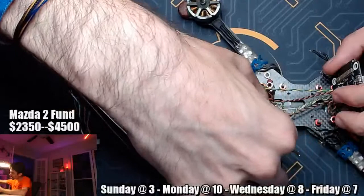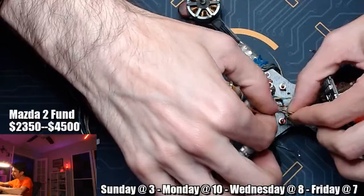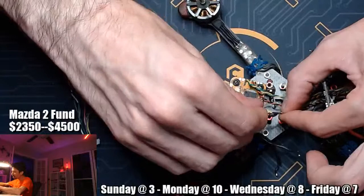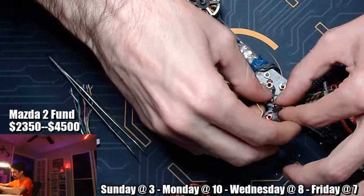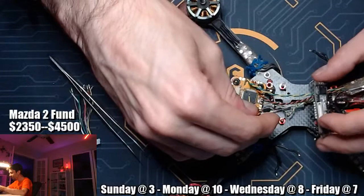And again, this is a little bit different. This rig I have the camera being powered by the 5-volt out on the VTX. That is a very clean source of power for the camera. I don't necessarily know if it's worth it to do it this way, to be completely honest with you guys, but it's fine.